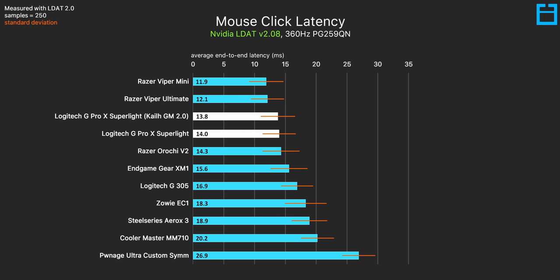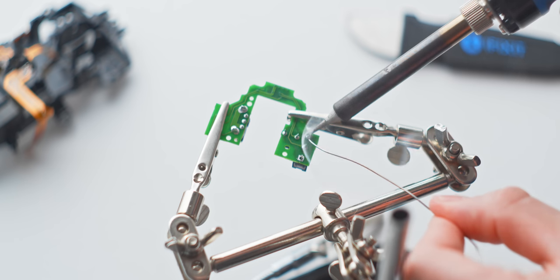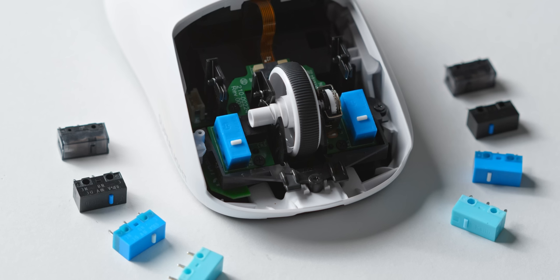This is the result we'd expect. So really a pretty quick, cheap, and effective mod — most useful for mice like the G Pro Wireless and the G Pro Superlight where the stock Omrons either fail you by double clicking or just don't offer much feedback. This is also a pretty easy place to start learning soldering if you have a fine enough tip — a really straightforward process. The switches themselves are only a couple dollars each, so not a lot of money invested. All the tools you'll need are linked down below. As always, huge thanks for watching and I'll see you all in the next one.